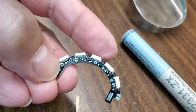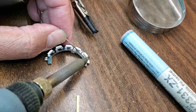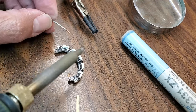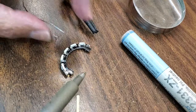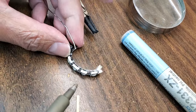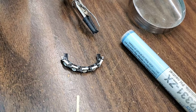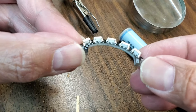Yeah, that looks good. It is key that the LED stays while you try to solder — imagine if you had to hold the LED in place while doing this. The fact that the LED stays where it is is really helpful. That's really easy. Just heat up the pads, then to do the other side you go in from the other direction because the iron is on the right side. You can go in between the LEDs no problem. Just heat it up, jam some solder in, and I think that did it — pretty good solder in just a few seconds.